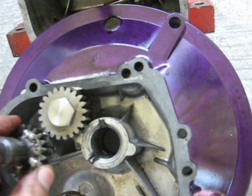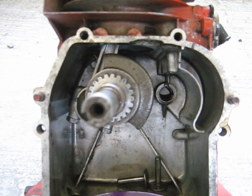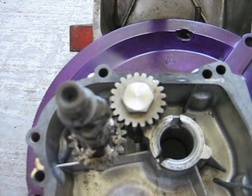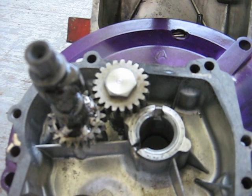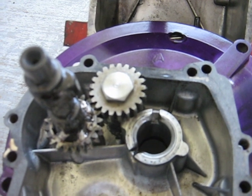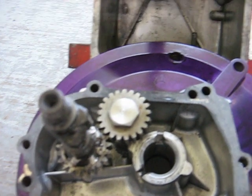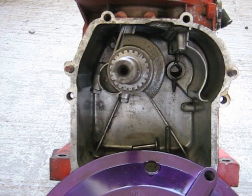So this engine actually allows the air to expand quite a bit, since the valve is only open for about a quarter of the piston stroke. After that the inlet air is cut off and it expands the rest of the time. That's not really the case with some of the other engines I've made, like the half speed camshaft ones.